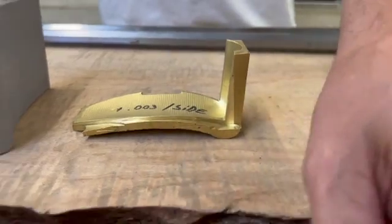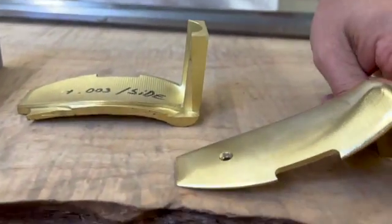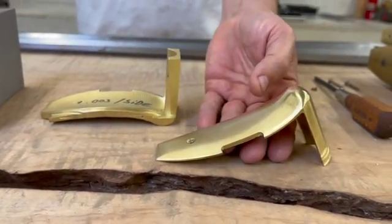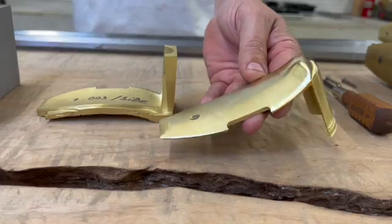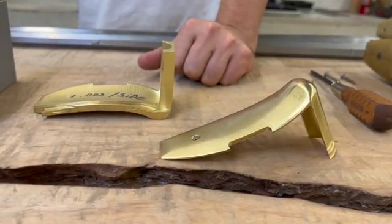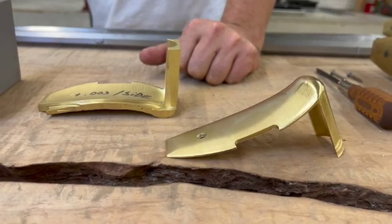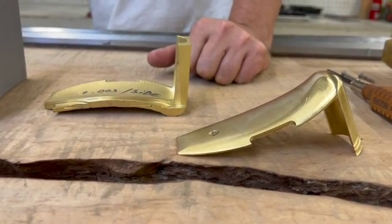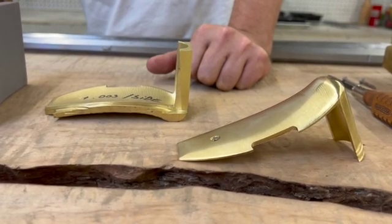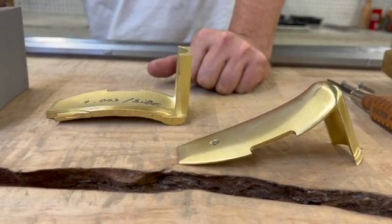The second operation does everything on the outside and turns it into the finished part you see. We're able to machine a butt plate in two operations using a three-axis mill with a fourth axis — so we're using a rotary axis as well.